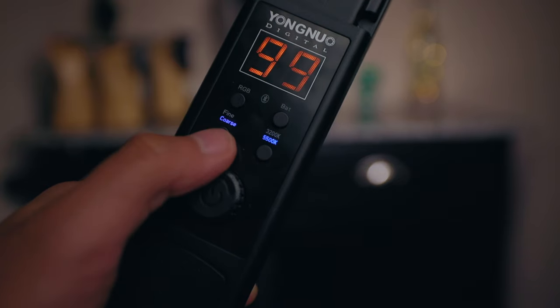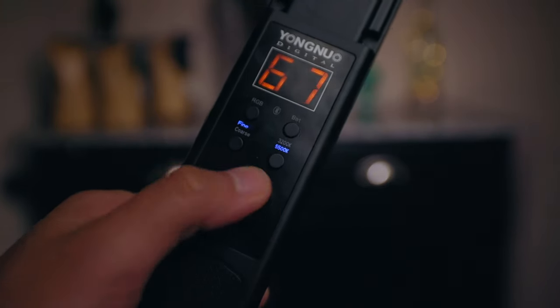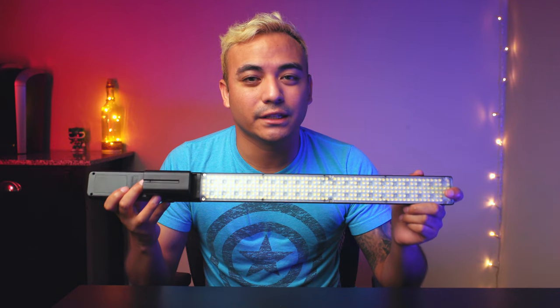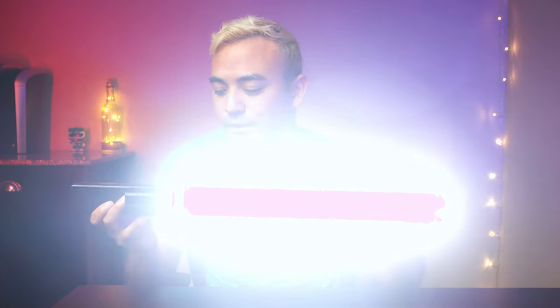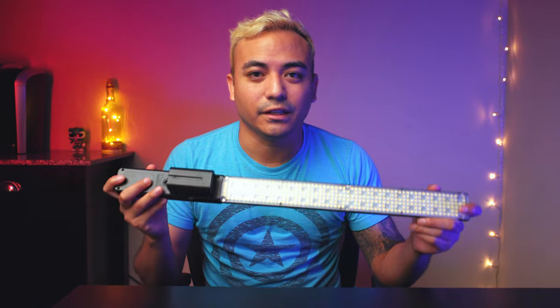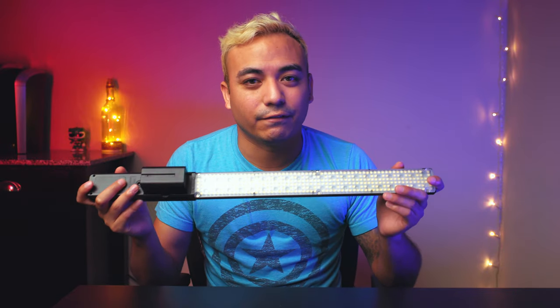So let's talk about the white LEDs. You can choose with a button between 3200 and 5500 Kelvin, and you can adjust them by increments of 10 in the coarse adjustment and by ones in the fine adjustment. At full power, these lights are super bright. This right here is at just 1, and we can crank that all the way up to 100. As you can see, it probably just blows out the whole image — even at arm's length, this thing is super bright. You can mix the colors, so you can add in the warmer lights with the cooler lights, and if you turn all of them all the way up, somewhere in the 4000 range, you're going to have the most light output, just not necessarily white balanced to daylight.